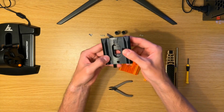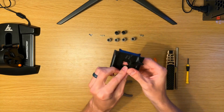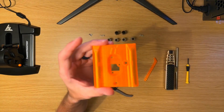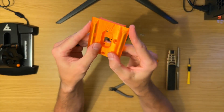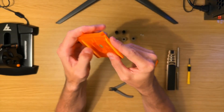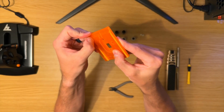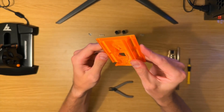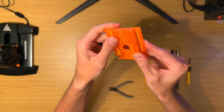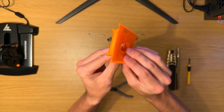I'll be using the orange one — this is just to give you a look. The black is very pretty; I'm always impressed with how black PETG comes out, but I'll use the orange just for contrast to help demonstrate this. First thing I'll do is pull the major debris off. There's always usually a string coming off the top where the nozzle moved away after it finished printing. I'll pull all the major strings off because I'm about to flash it with a torch-type lighter to burn away any excess, and I don't want those strings to bead up and become a strong piece of material attached to the part.